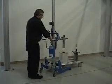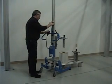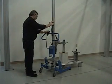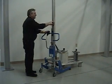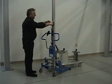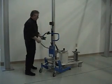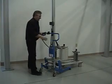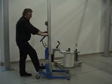You line up the roll with the core, insert the expander into the core, expand it until the light comes on, raise the roll up, back away from the pallet, and set the brake.